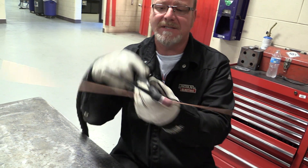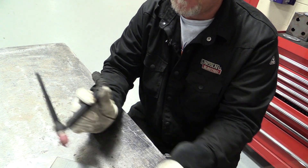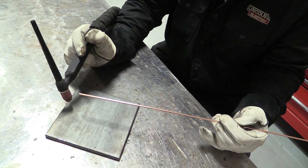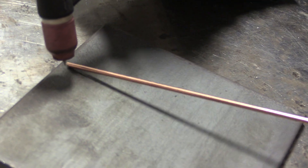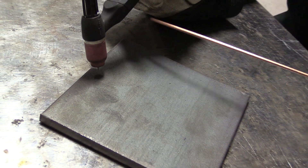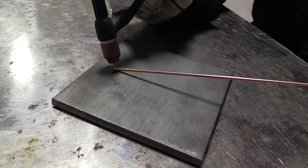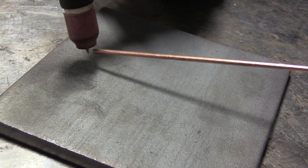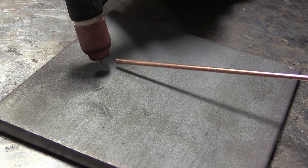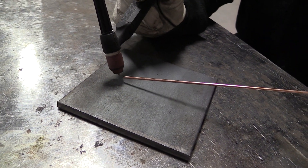That's one thing to learn that will help you right off the bat with any TIG welding you do. Secondly, when you guys first begin — I've got my TIG torch, and there are other videos on the TIG machines and how we get this started — I want to show you a couple of things that will help. A question we get all the time: how far should my tungsten be from the plate? Remember, the further you get your tungsten away, the bigger the heated area. So you want to keep your tungsten as close as you can to the plate, but you also have to save room for the filler. I can't come in and dip that filler and touch that tungsten each time. Sometimes people get it really close and then back the tungsten away when they dip the filler, getting into this habit — and that's really not a good idea.